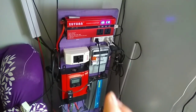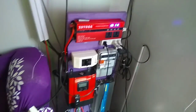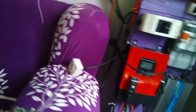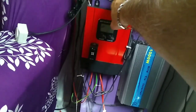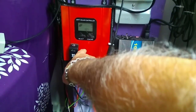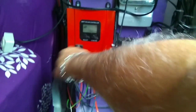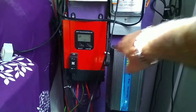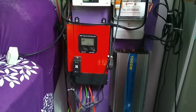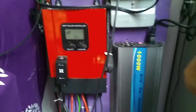My batteries are still here. It's a brownout now, and I really want to show you how important it is here in the Philippines to have solar. Right now you can see the system itself — see this 105 watts? That's exactly what's being pulled in the house right now. We have 105 watts. I have 1,200 watts on the roof that we can actually pull from. And this right here is showing what it's pulling in now — that's all that's needed. Right now we're only running 105 watts for the refrigerator.